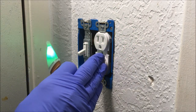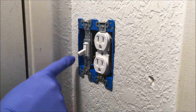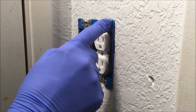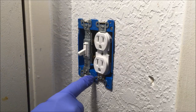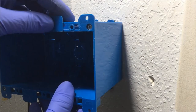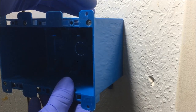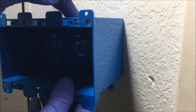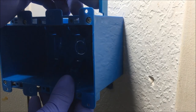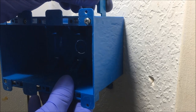Now I know I don't have power coming to either the outlet or the light switch. In my case, I'm working on an electrical box called an old work electrical box. When you put the box in, the tangs or tabs of this electrical box sit up flush against the sheetrock. When you put an old work electrical box into a wall, after you cut the sheetrock and put that box into the wall, you screw these screws in. As you're screwing these screws in, a little flag or tab comes up that secures the box to the sheetrock on the back.